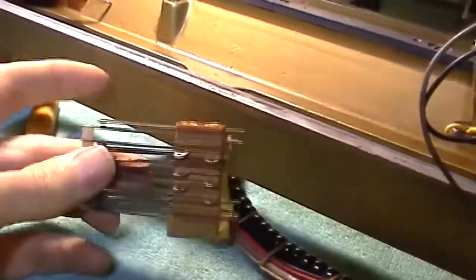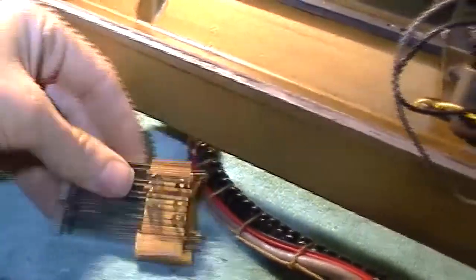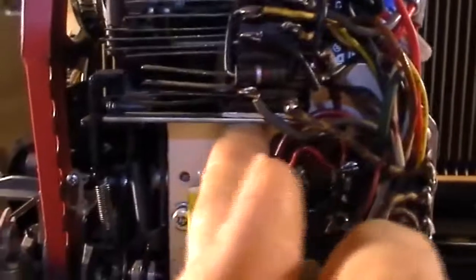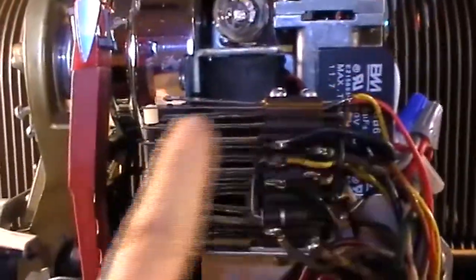So I ordered a cam switch. These pieces come apart, so I ordered one and added it to the top of the existing switch to get this thing to do the 33 rpm records. I thought I was going to need longer screws because they come out down in the bottom, but it turned out the original screws were just long enough — there's a little bit still sticking out — so luckily I didn't have to go to the hardware store to get longer screws.